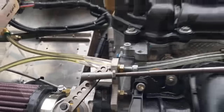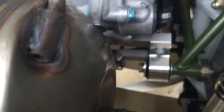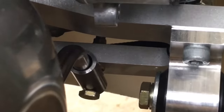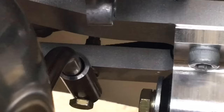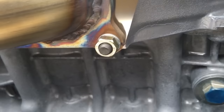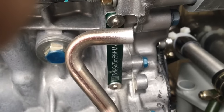The muffler you just slide on — it's a slip fit up here — then put your hanger for it in place down there. Just drill a quarter-inch hole centered to the engine mount where that ends up when the muffler is level. There's also going to be another hanger up here, mounted to this stud and the other stud right there. That part is in the making right now, but it'll come across like this and pick up this hanger for another attach point for the muffler.